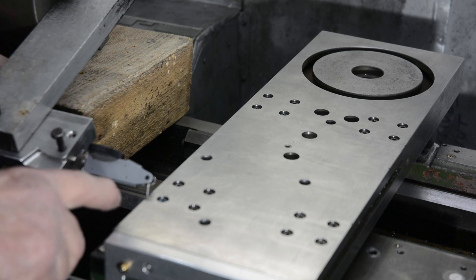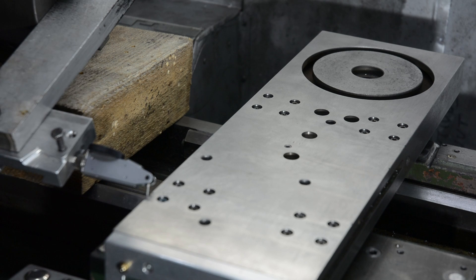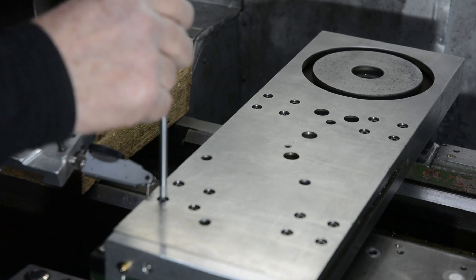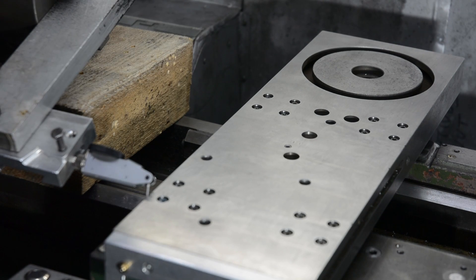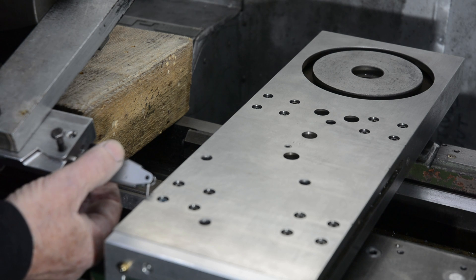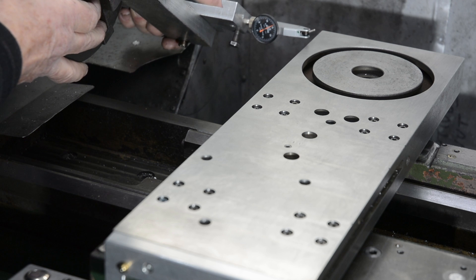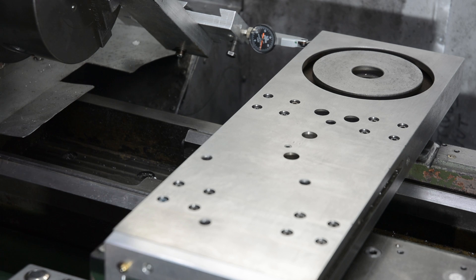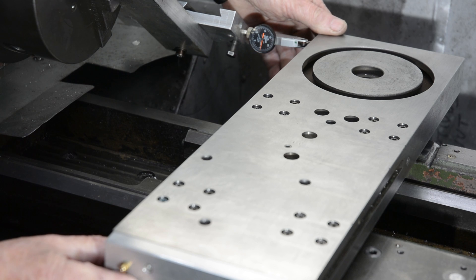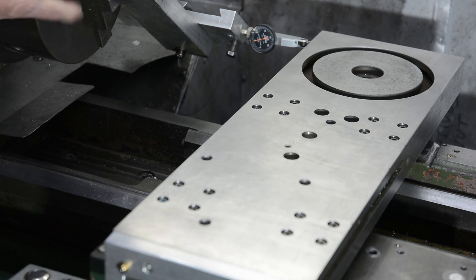I'm going to start this side — it's indicating just about opposite this bolt hole, so it's largely going to pivot about here. I'll nip that one up a little bit tighter to give a pivot position, so it'll be mainly moving at the other end. I'll zero it. Sweeping over here it's showing about five thou, so I have to bring it the other way. That's set on zero now. Let's come back and see if this has moved — no, that's spot on zero too.